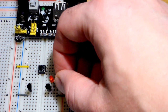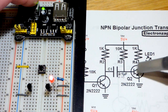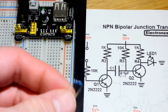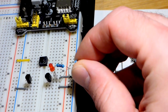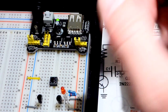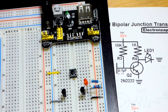I'm putting the 1 kΩ resistor up here to where the anode of the LED is. Now if I turn the power on the LED turns on — we have a current path from positive to negative, nothing's going to the base of the transistor so it's off. Stay aware of that, it'll come up again. At the base of the transistor we're also going to have the capacitor. I'm placing the 10 kΩ resistor at the middle pin — the base — going directly from the positive rail. The resistors are insulated so they won't affect each other if they bump, but leave a small gap so they don't get too warm.